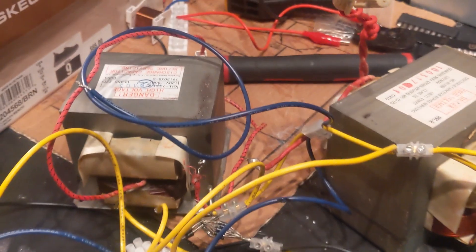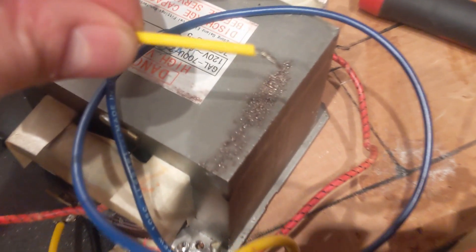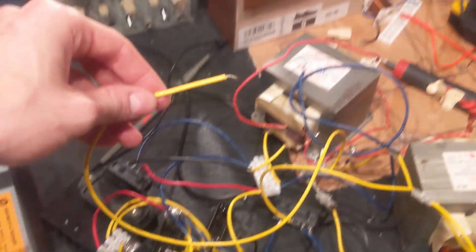When I plug it in, you'll notice a couple things. First, there's a ringing sound. Secondly, this lead right here is the high voltage end — if I short that across the ground of the casing on the transformer, you get an enormous radiant spark. At idle, that takes around 25 watts because the resonance and the spark gaps have to go.